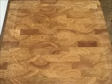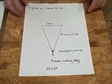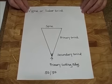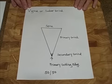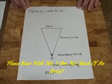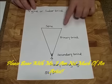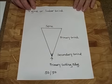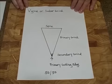Let's cover our basic kitchen knife grind types. This particular grind type is one that most people are familiar with. It's called a V grind, or a saber grind, and it's what you will find with most of the European-made knives out there — French, German, and even American Western European style knives. Some people call it a V, some people call it a saber. This is your spine, this is the primary grind — it goes from the spine to your secondary bevel.